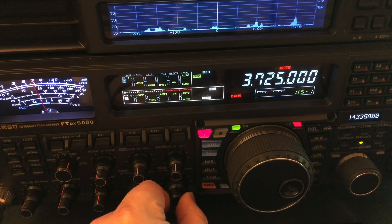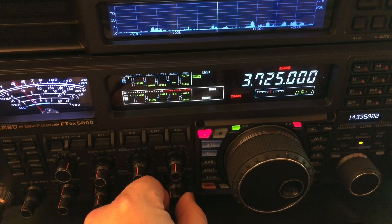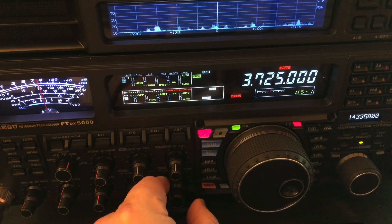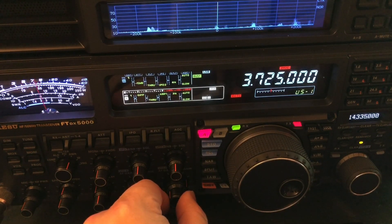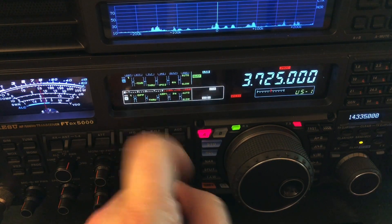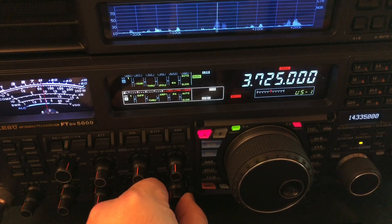I just want to show you some icing on the cake. When they're not talking, the S-meter goes down to near zero with very little noise — that would be more than adequate. Even without RF gain it's pretty quiet, but if I roll my RF gain back a little bit you can see the S-meter start coming up. I'm saying I don't even want to hear S0, S1, or S2. These guys are still pretty strong even with all this padding, attenuation, and IPO2. There's no reason to even hear any noise at all when they're not talking.